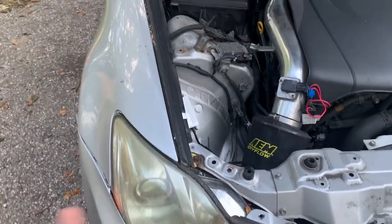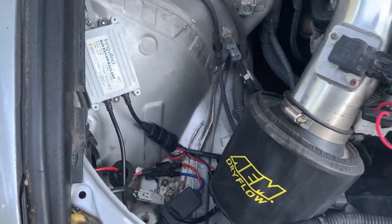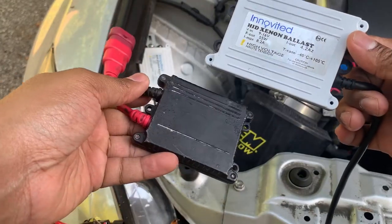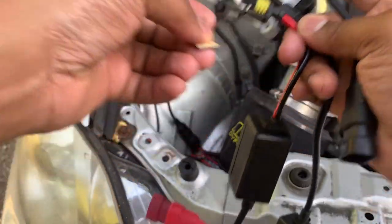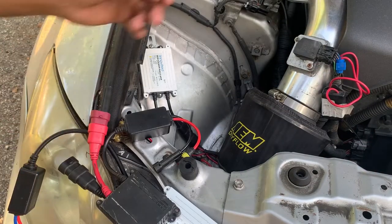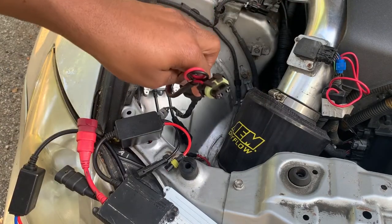When I flip the switch to turn it on it actually flickers. So I'm gonna swap that out for another ballast and see if that will address the issue. I often keep spare parts just in case — you never know. We'll give it a shot. I want to disconnect my wires. All right, so we got this wire disconnected.